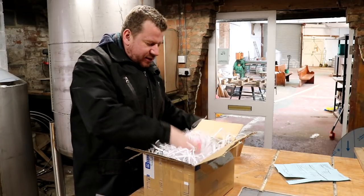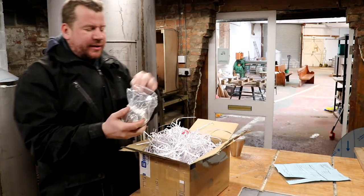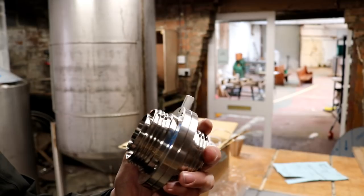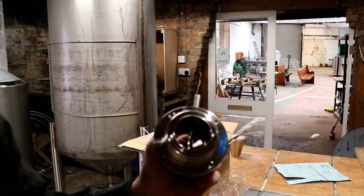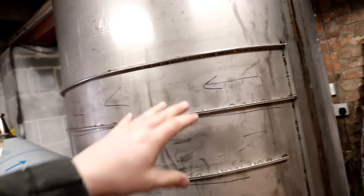Here are my concentric reducers and down in the bottom we have the 2-inch male-male RJT butterfly valves. These are what I had on the RVB kit as well — I would have liked to have kept some of them but we had to sell in the liquidation sale — but these are top drawer, the dog's danglies. And there we have it — we have the glycol cooling matrix on. The glycol will run across and down, across and down, across and down, across, and then we'll have an exit port over there.